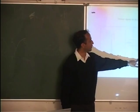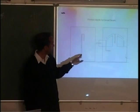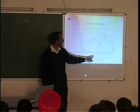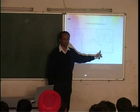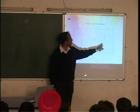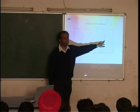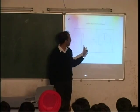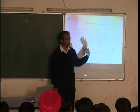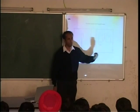This is the top, this is the bottom. You see, in this region, it's a microstrip. Top strip, notice some things are happening in the strip. Okay? It's not the uniform strip. And there's big metal. But this big metal doesn't go on being big metal all throughout. There's something here, something poking out, and then there's a shape. This is actually the dipole. How is it fed? It's a non-contact feed. See this hook kind of structure, it falls here. Okay? And the electromagnetic signal is coupled between this, and that radiates.